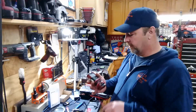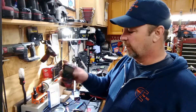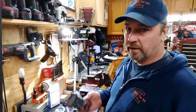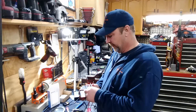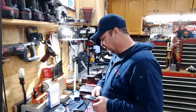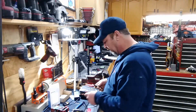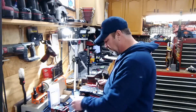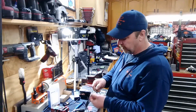This is my little Innova meter - my go-to meter. I've had this for like 17-20 years. It never dies - I think I've only put batteries in it one time. I'm just going to put it on the buzzer. We know which one is positive on here but we don't on the other, so I'm going to assume it's this one. And it's not. The positive is the one that has the stripe on it - we need to know that.